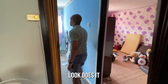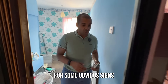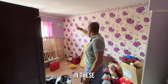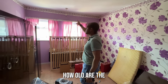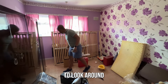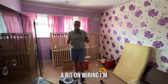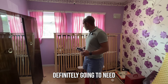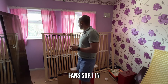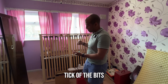Going through the rooms, tick off whether they need painting, wallpaper, or carpet. Look for obvious damp signs near where the guttering goes. Check the electrics — how old are the ceiling roses, how old are the sockets. Bedrooms have to have at least two sockets. This property definitely needs some rewiring work; the electrician will confirm if it needs a full rewire, but there will certainly be a lot of remedial work, fuse board work, and extractor fans needed.